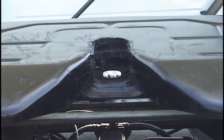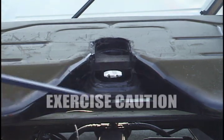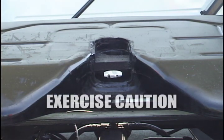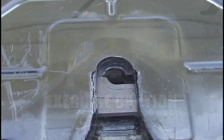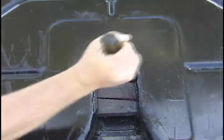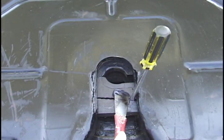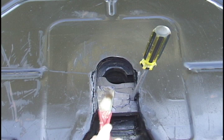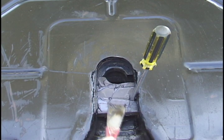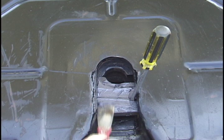First, trip the wheel closed by pushing the bumper off its seat with a pry bar. Be careful, when the mechanism closes, the handle moves in quickly. Next, pull back slightly on the pull handle, separate the jaw and wedge with a big screwdriver, and distribute grease between the jaw and wedge, pressing it between the serrated surfaces. Fontaine recommends a moly-based lubricant such as Mobil Grease Moly 50 or equivalent.